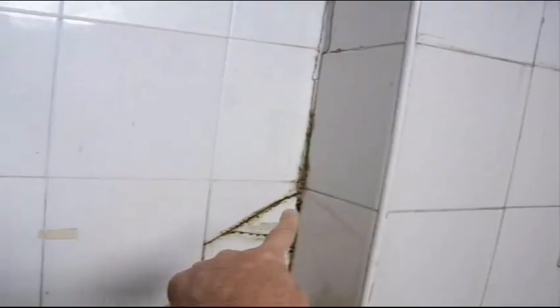This is the other side of that same wall. You can see the leak starts up somewhere up here, comes down here and follows the tile. The brick swelled up and cracked the tile and pushed them right off. This is a close-up of the damage — you can see the brick is actually spalled off. The wall is about half as thick as it should be. There's a piece of tile laying down inside the crack. It's a real mess.